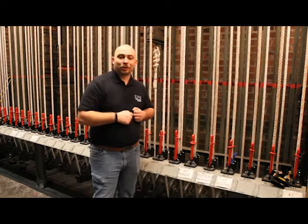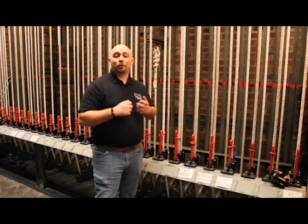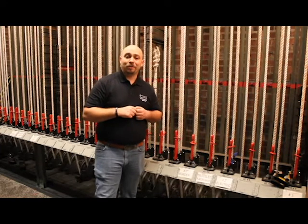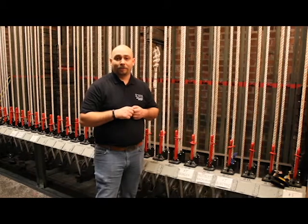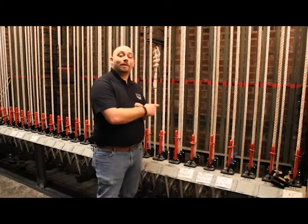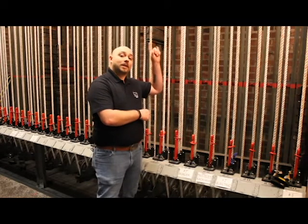There are a few other terms we should talk about. The first one is crash rails. There are two crash rails in the system. A crash rail is a metal bar, usually made of angle iron, often with a piece of hardwood attached to it. There is going to be one crash rail at the bottom to stop the travel at the bottom for the arbor, and one at the top to stop the travel at the top for the arbor.